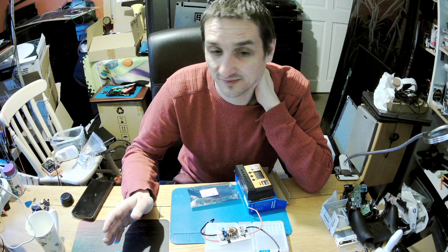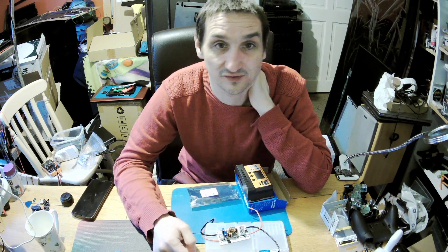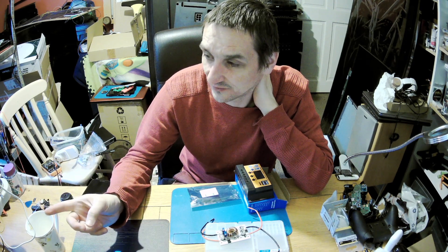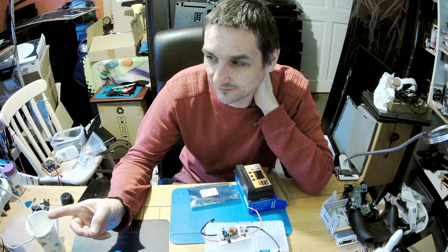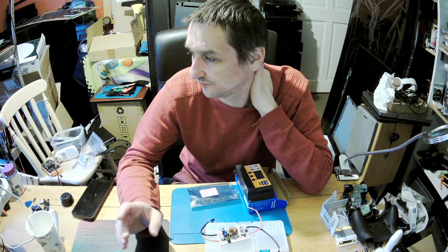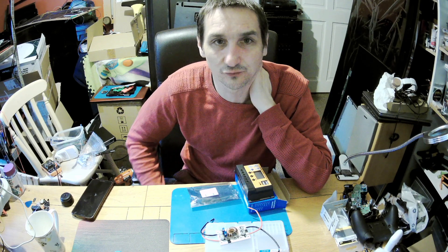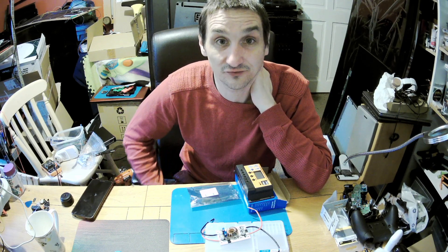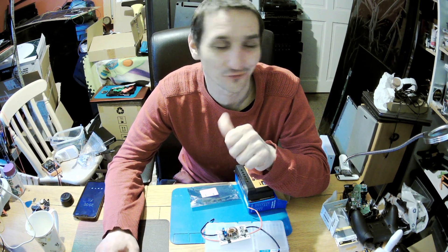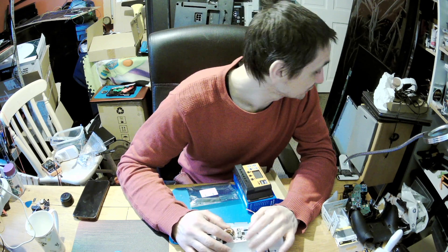Even if I use all devices apart from the hot air, I won't use more than 200 to 220 watts. My PC takes about 80 watts, with audio about 100 watts on work - not gaming. The soldering iron can take up to 50-70 watts peak. Then the microscope. So I can use over 200 watts but never 300 watts continuous - so 300 watts will be enough.